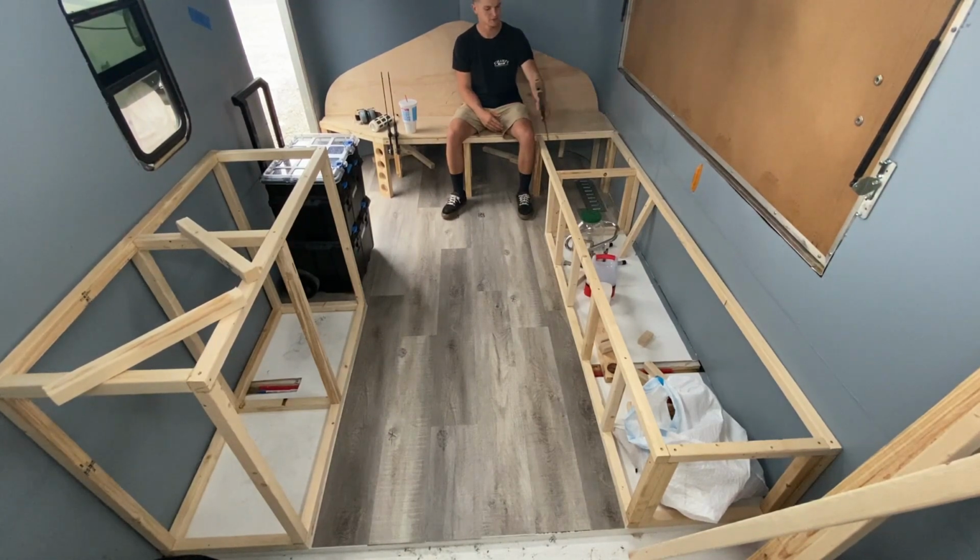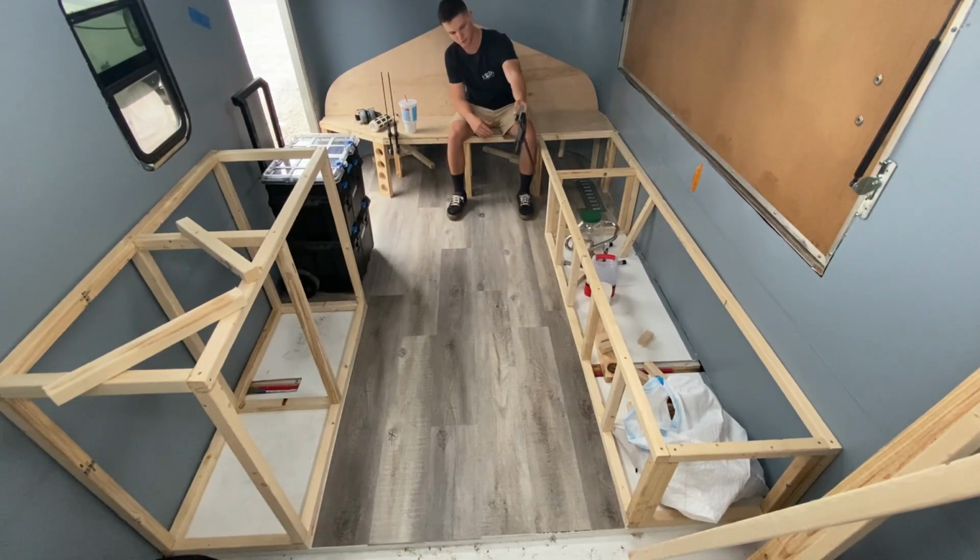But it's a 21 inch, maybe 18 inches in the middle here. And I just don't trust 1/2-inch plywood spanning that, so I'm going to go ahead and take some more boards this length, 1, 2, 3, 4 of them, right where the rest of these little studs are, and using little L brackets, which isn't ideal for structural, but I want them to be removable later on if I need to access any of the plumbing stuff down there, maybe need to pull the tank.